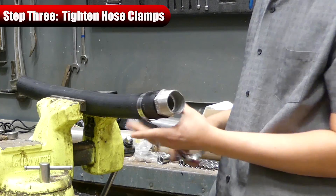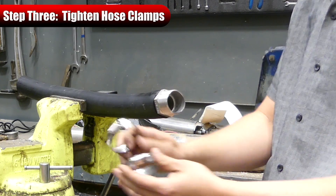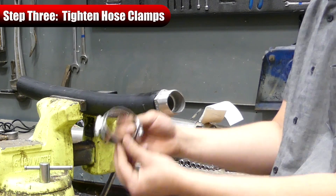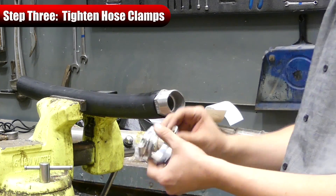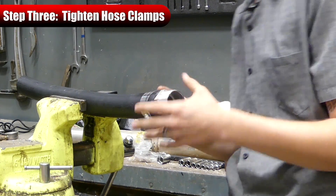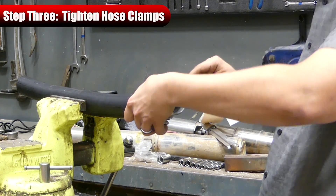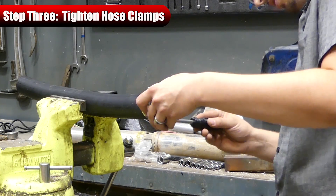The next step is you put your clamps on. The important thing with the clamps is you want to make sure that they're facing opposite directions, and when installed they're configured in this fashion. That's important because each clamp is pulling the opposite direction and you're going to get the most leverage and the best seat with this particular install. You want to be relatively quick when you're installing these because this poly pipe cools down pretty quickly, and you want to take full advantage of the flexibility when you're installing it.